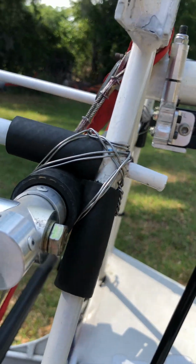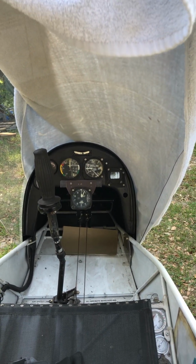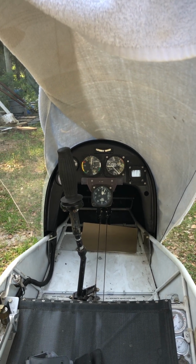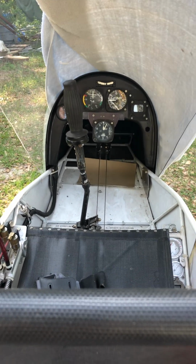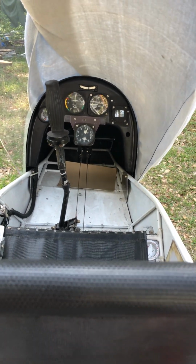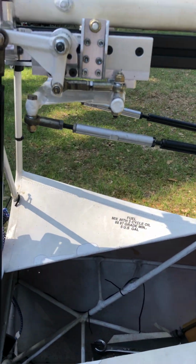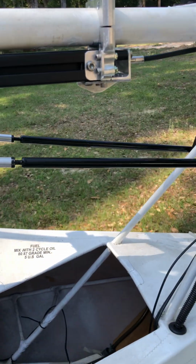And now I'm going to put this in full flaps. And now you can see it's about 11 o'clock. I mean, that's not terrible. And you're only in that position just slightly while you're touching down, or just before touchdown, or just while you've got the flaps fully, radically deployed down at a 45 degree or 40 degree. Most of the time I anticipate not even going to that extreme, but coming in using 30 degrees flaps when you're landing, or maybe even 25.